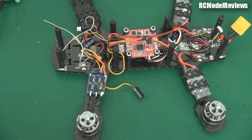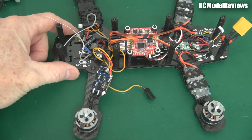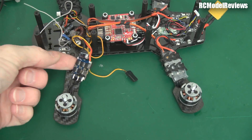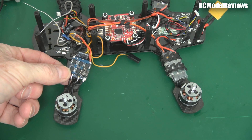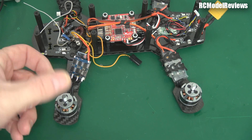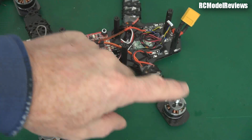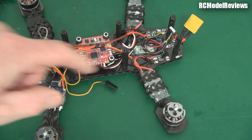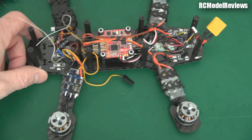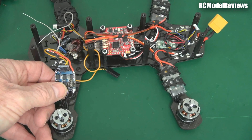Here's a situation I found myself in. My little Blackout mini quad has blown an ESC. It actually did a few unexpected flips on a couple of flights, then it came right, then it did a couple more flips. So I replaced the rear two ESCs because when I landed one time I noticed one motor seemed to have a bit less torque than the rest. But then on the next flight it flipped again and the magic smoke came out.